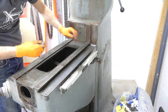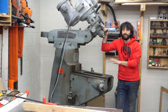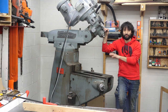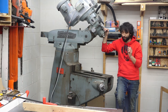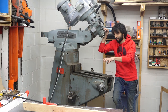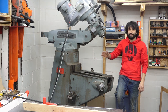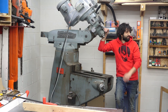One thing I noticed is I sort of answered a question I had in the back of my mind. This machine came with only a Y-axis DRO. I wondered why it only had a DRO for one axis, but whatever this thing had been used for before involved really excessive Y-axis use only. I pulled the Y-axis lead screw out and you can literally see the wear on the threads. The wear on the ways of the knee for the Y-axis isn't terrible — that's what you can see when you buy it — but the wear on the underside of the saddle, which rides up against it, is heavily worn. So this thing was used only for moving in the Y direction. The X-axis is in still pretty decent shape. You don't know these things until you pull it apart.